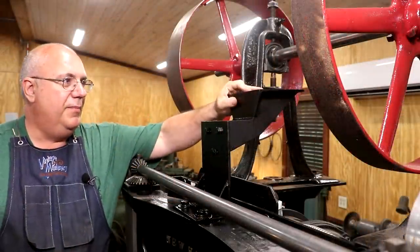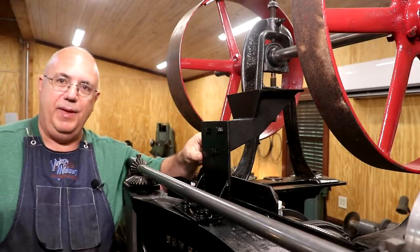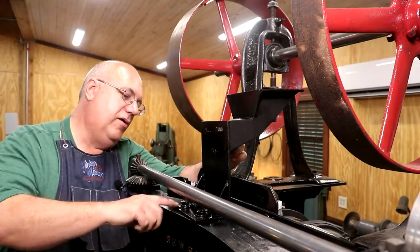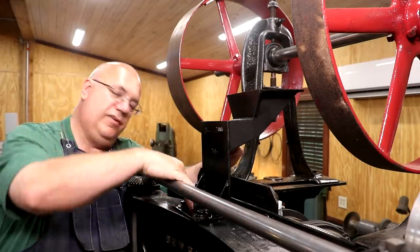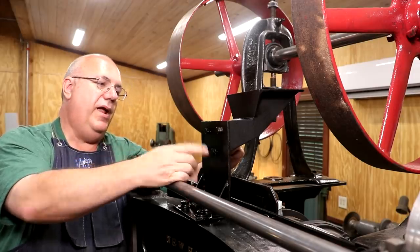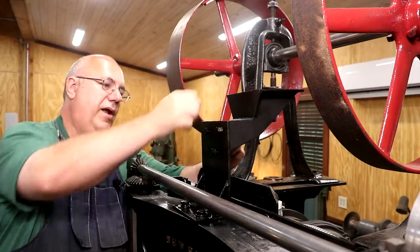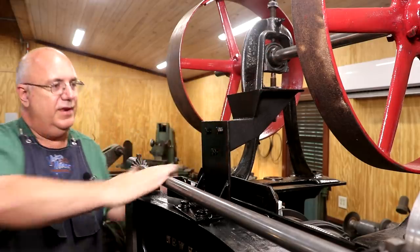Well, here we go. I've got my bracket all put together and mounted. I went ahead and got it painted, cleaned up. We got our holes drilled in the top up here. These are just half inch bolts that are drilled and tapped directly into the casting. We bolted this bracket down, then the other bracket, again, bolted this one. Appears to be nice and steady.